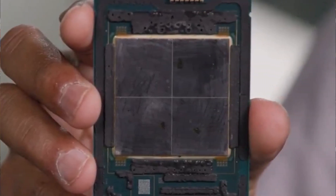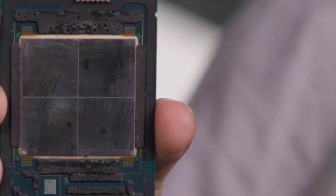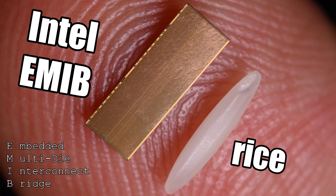Intel is making a distinction between chiplets and tiles, and it all comes down to how they're binding them together. On this channel we've spoken about Intel's Embedded Multi-die Interconnect Bridge, or EMIB, which is basically an interposer you build into your substrate, into your package, where you can put two die on top with connections between them. It's meant to act like an interposer but you only need a very small piece of silicon to do it — unlike a big interposer which needs to be larger than all the chips involved.